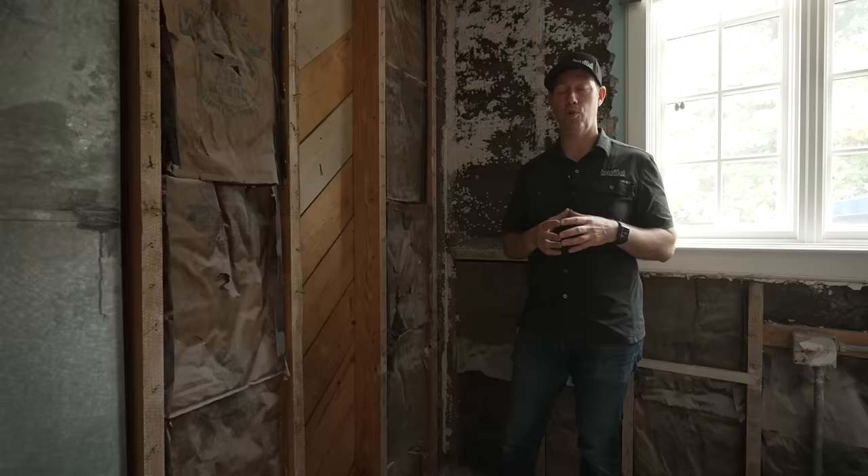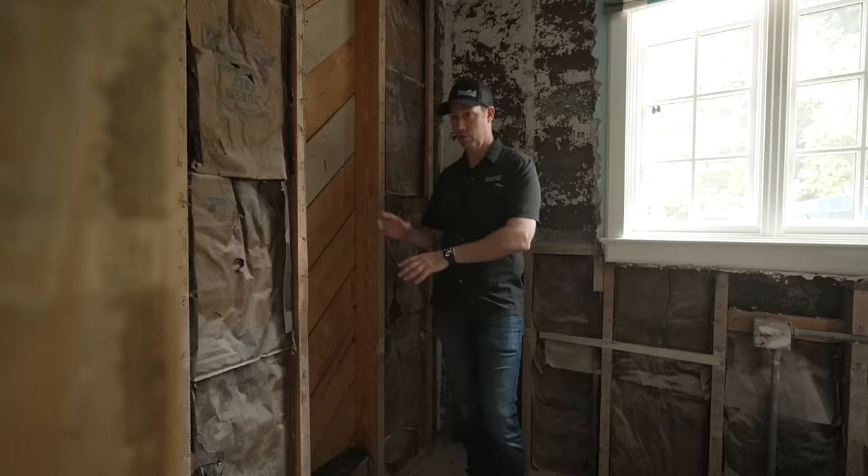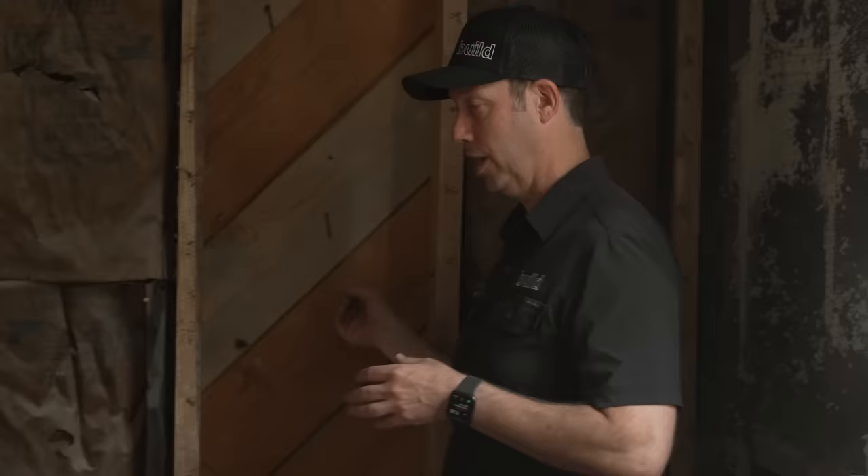If we're going to insulate this cavity, I'd go back with a similar type of insulation — new rock wool insulation batts. I might still be cautious about adding sheetrock on the inside of a house like this. Anytime you can go back with plaster in a house that had plaster, you're going to be better off. Plaster doesn't have any paper facing — there's nothing that could cause rot or mold or problems in the future. In the end, it's a tricky question. Be cautious about insulating a 100-year-old historic house like this.